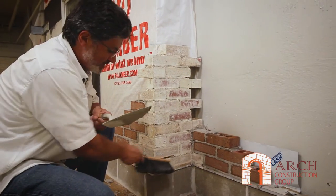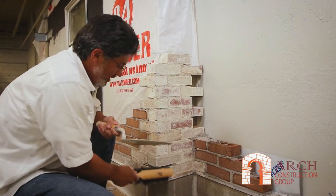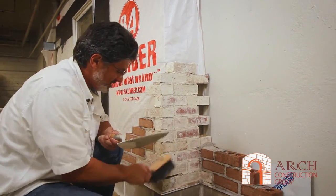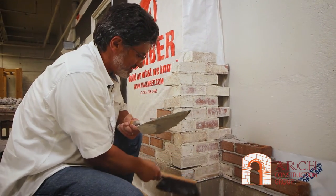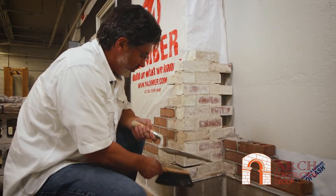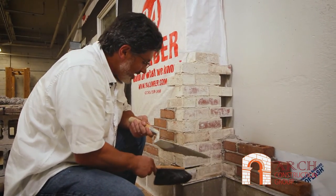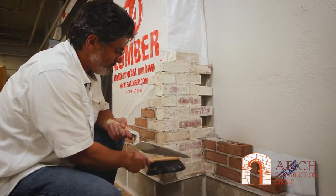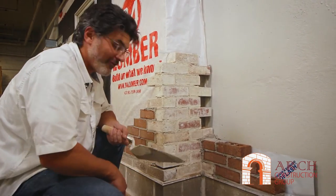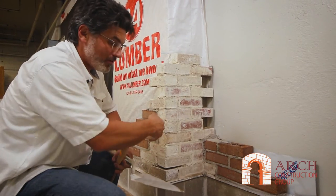Now I'm going to tuck in a corner pull hole. We're going to pretend that this is done after the fact, just like it is here, and this mortar is all hard, this brick is set. If I just pulled the pull and this wall was all fresh, I would just point it in. But if I'm pointing a corner pull hole after the fact, I'm going to dampen the wall first.